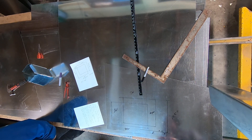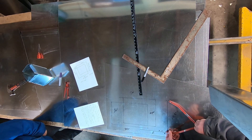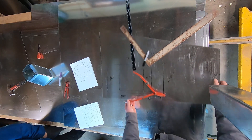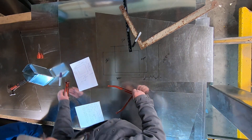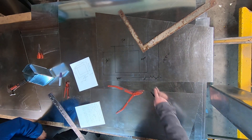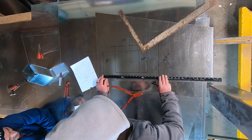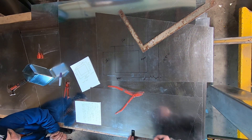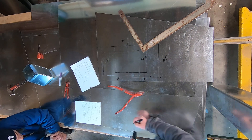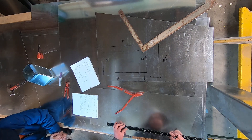Let's build one piece at a time — let's build the bottom piece first. The total height of the bottom piece is going to be from this measurement here. I'm going to draw my equipment flange. The bottom is going to have an equipment flange on the 13-inch side. If I'm doing a double equipment flange I'll put one inch; if it's a single equipment flange I'll do a half inch. I'm just doing a single equipment flange to save time.